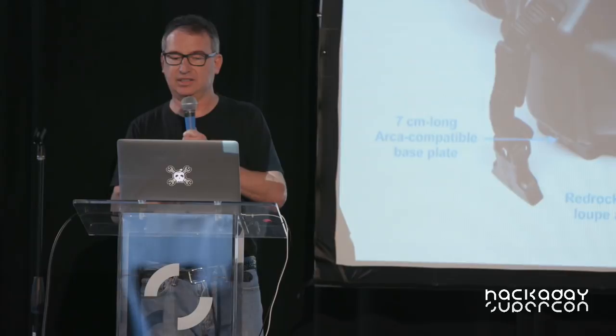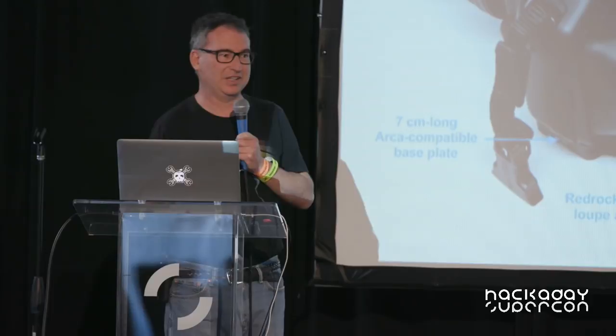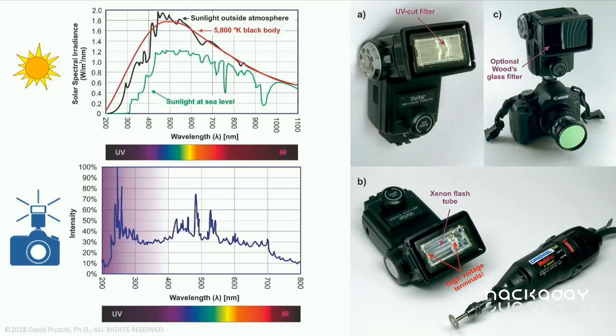This gives you a camera that allows the UV signal through, but now you need to see what you're photographing, since the camera passes light your eye cannot see. The solution is to compose shots in live view mode — a great feature of digital cameras. You also need light: sunlight works well, but at sea level a lot of UV is absorbed, so adding a UV flash is very helpful. Flashes usually filter UV, so you may also need to modify those.